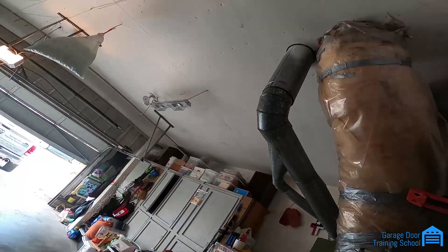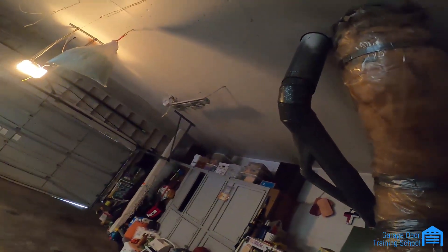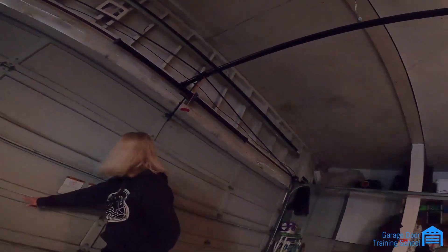That's why I asked — they've got steel doors that are really light. Most people are getting steel doors nowadays. See how on the ends you can see light coming in on both sides? That's because these cables and those big springs are actually pulling — it looks like your door's cockeyed too. They have a lot of tension on them, and that's why these ends come off the ground. It's called smiling. Eventually your whole door will look like that, so we put braces on it and bend them so it's stronger. With a steel door everything is straight — true lines, no gaps.